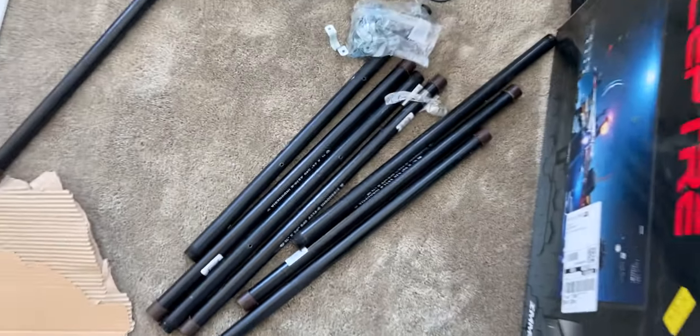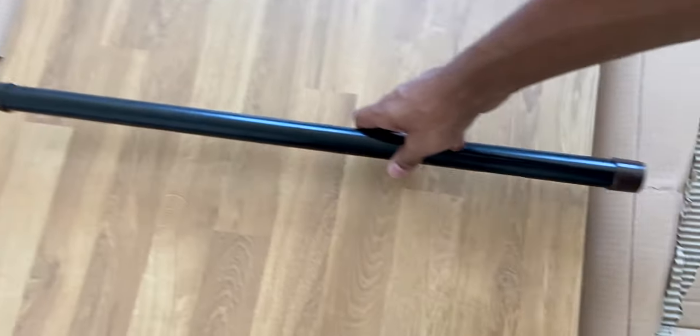The reason I'm using black iron pipes instead of the typical L-brackets is again because of the bending problem with particle boards. L-brackets are usually about a foot or 16 inches long, and I don't want the desk to bend forward over time. Larger two-foot L-brackets are more expensive, could block your knees, and if visible when standing they kill the entire floating look. So black iron pipes are your best bet — four would support it well, but I used seven to feel really safe and sturdy.